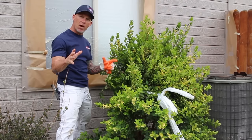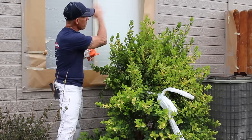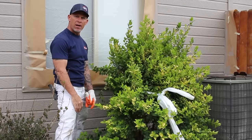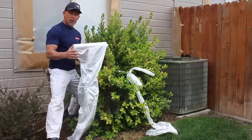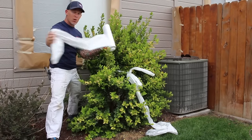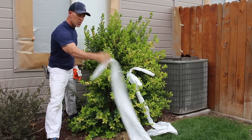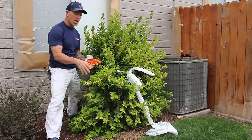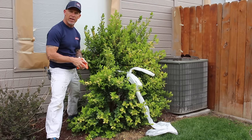If you're using the proper tip and proper pressure, you're not going to get any fallout on these plants. We've already painted around here and these plants don't have any overspray because we're using the proper methods to control overspray. If you've never seen a roll of 9 by 400 plastic, this is just what it looks like — it comes in large boxes and I pay about $10.50 a box. That's a pretty large roll; it goes a long way and is very inexpensive.